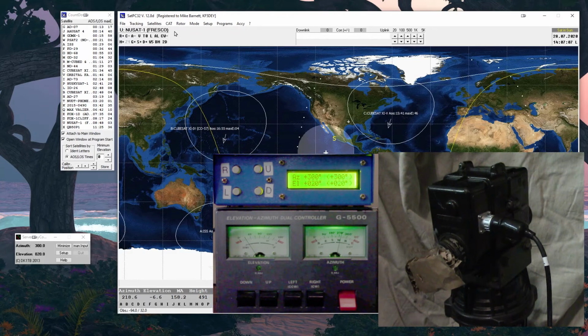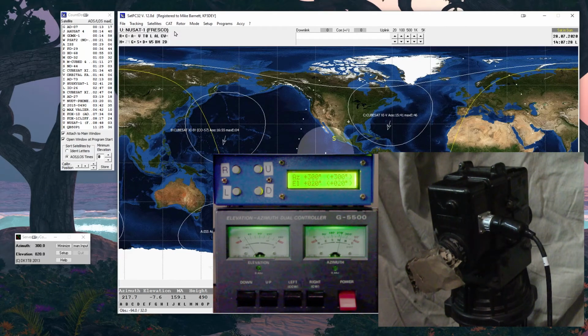And then you have to make another pass, and the safest way to do this would be, again, before the antennas are mounted, with just the coax mounted, do a rotation all the way to the right, to the full direction, to make sure that you don't have any stretch of the cables. So they should be able to track nicely without getting hung up or stretched. And then once all that's good, I'll mount the antennas, hook up the coax, and again, before we commit, with everybody watching, do some manual adjustments to full up and the left and right, and make sure nothing's binding and the thing's going the correct direction.